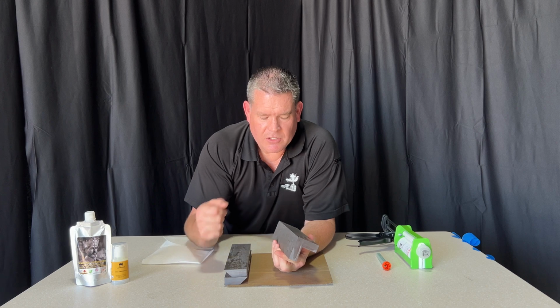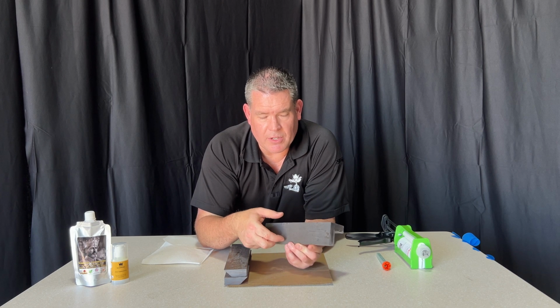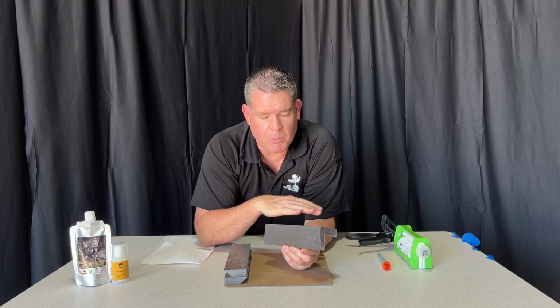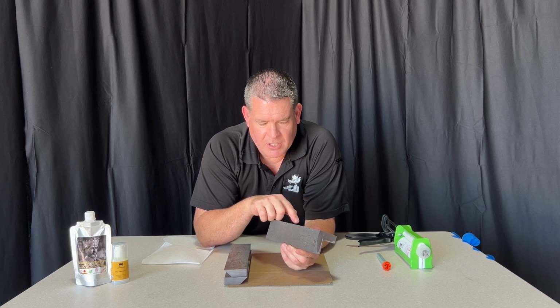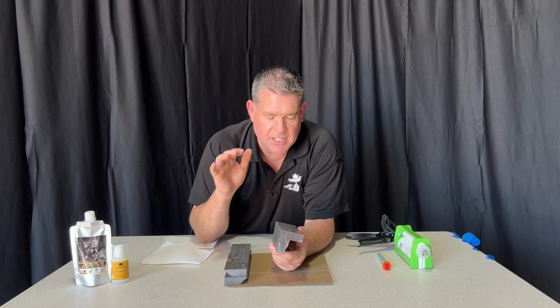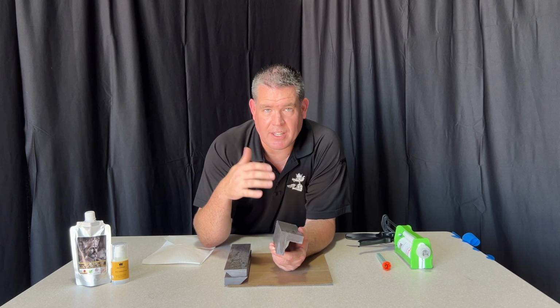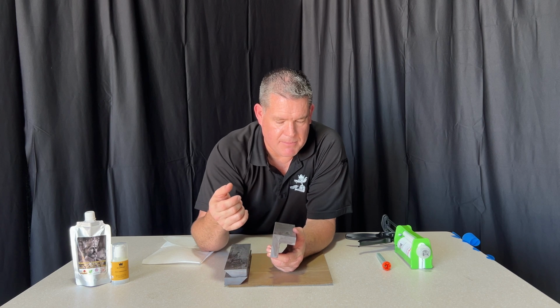waterfall edge. So whenever you're doing edges in porcelain and there's any sort of drop edge like this, it is almost always going to be a miter edge, because nobody wants to see this top coat and then have a band of material on the edge. It looks pretty tacky. I do know there's a lot of people that are doing that for pool coping or bathroom vanities where they're just leaving it the 2 cm thickness.